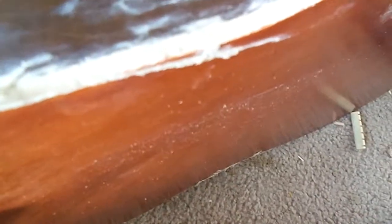There's a little bit of a gap because with the jigsaw we took a little too much wood. Someday when I get more money we're going to buy a scroll saw because they have a better, even cut. To fix that, I'm using wood filler — good old Elmer's wood filler. You can see I went around and that gap is pretty much gone. Just where it's gappy, where wood's missing, we went ahead and repaired it.